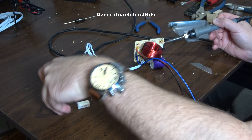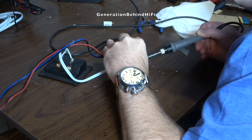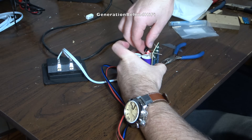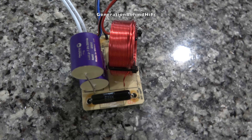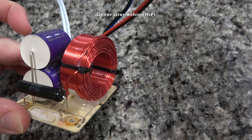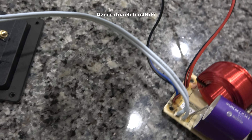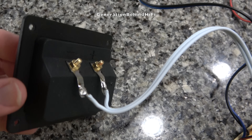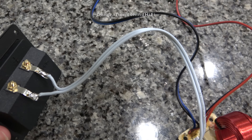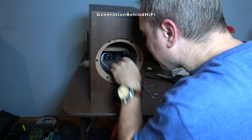After installing the new capacitors, I posted a picture of the crossover upgrade on my social media. Some of you were quite surprised that I left the sandcast resistor in place. The reason is that in the past I haven't really heard any sonic benefit replacing them, and I was trying to keep the cost of parts down. But since I do have a nice wire wound Mills resistor in the correct value, I might as well install it to see if I hear any benefit. Here's the third revision with the Mills resistor installed. I also replaced the wire from the terminal cup to the crossover board with Super Series speaker cable with a 5N purity rating, and soldered the connections to the terminals instead of using push-on connections.